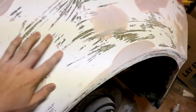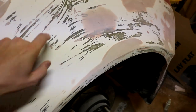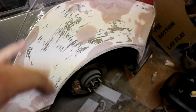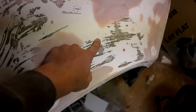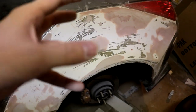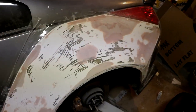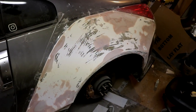You can see all these dark patches right here - these are where, as I was sanding it back down to the original shape, it actually went through the gel coat and down into the fiberglass underneath. That was a pain because every time I'd get through the gel coat it would create a little hole down into the fiberglass and I'd have to go in with body filler to fill those. You can see all these little dots all around here - those are areas that went through the gel coat where there was an air pocket that had to be filled with body filler and then sanded back down. There must have been about a million of them on this thing.